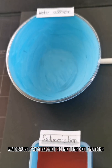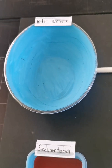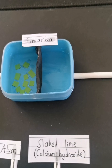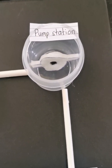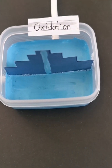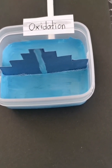Now I will explain the water supply system and its function. The water from the water reservoir flows to filtration, which removes large suspended particles such as tree branches and leaves. The water then flows into the pump station, and the pump station pumps the water into oxidation, where the process increases oxygen content in the water to get rid of unpleasant smells and taste.